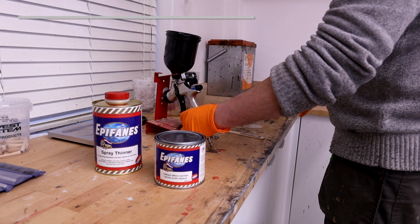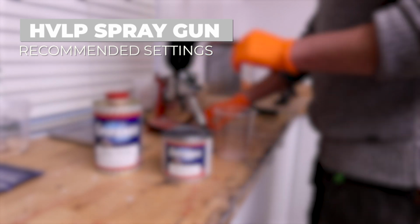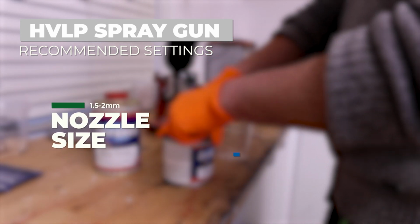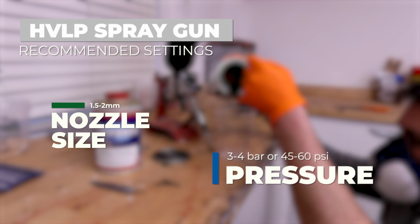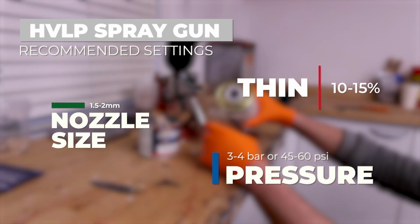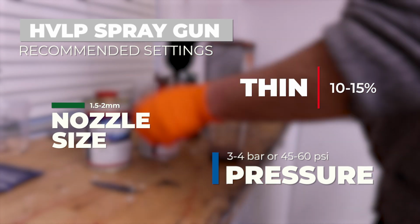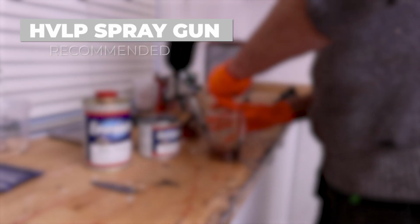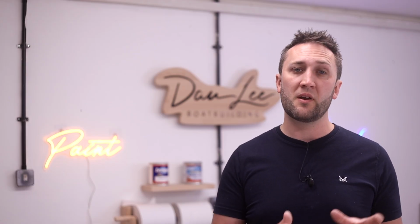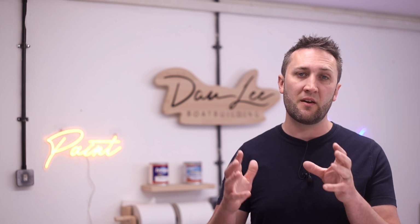For spray application, a HVLP gun is recommended and setup should be as follows. Use a 1.5 to 2 mm nozzle, spray at a pressure of 3 to 4 bar or 45 to 60 psi and thin the primer at 10 to 15% using the Epifanes spray thinner for single part paints. All coats should be applied in the same way with spray application. Do not apply wet on wet and allow each coat to fully dry before sanding, degreasing and then applying the next coat.